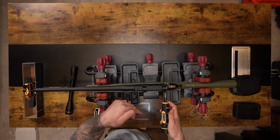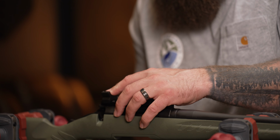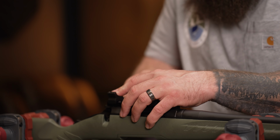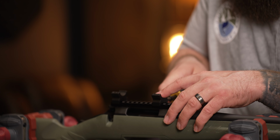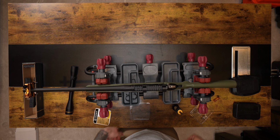Now here's where you can crank it down, okay? So again, we set this to 25 inch-pounds because that's what the spec said for the torques. Now I'm gonna twist. Twist. Now if you notice, you cannot over crank it, okay? Just keep slipping. Wheeler makes these, a lot of different companies make these. Valuable little tool if you're gonna be building guns.